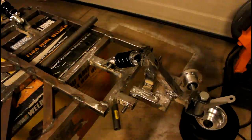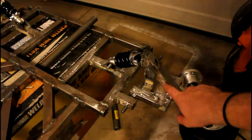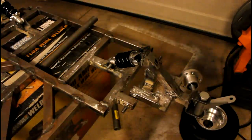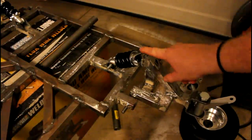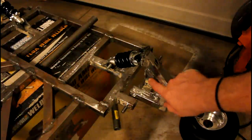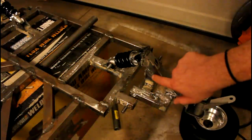The first update is with the front suspension — this is what I worked on first when I got back. What I left off with from the last video was just a 45-degree angle piece coming up out of the suspension arm with a tab on the end for the shock to mount to. I knew that wasn't going to be enough strength and support because there's going to be a lot of load and stress on this point. To counteract that, I wanted to add a vertical truss piece.